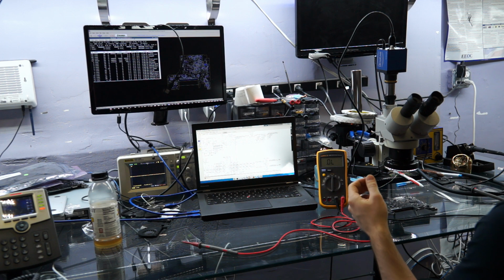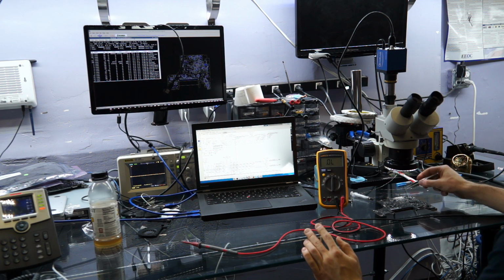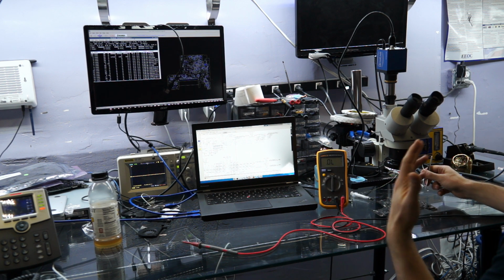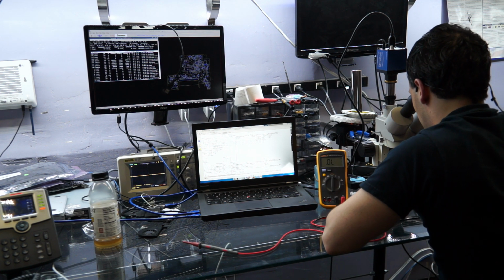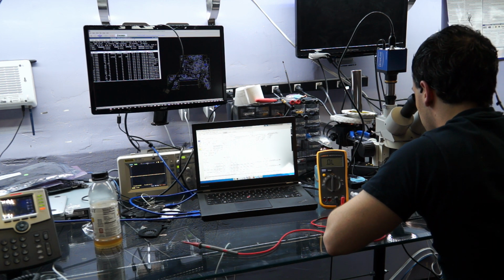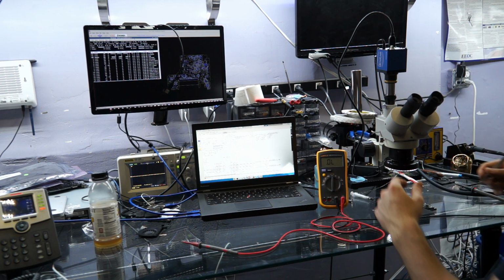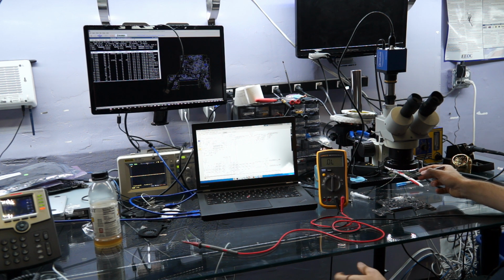Such is life. So the way I solder that underneath the chip is I use a combination of leaded and lead-free solder. Now, lead-free solder has a higher melting temperature, around 217 to 235 Celsius. Leaded solder has a temperature around 180 Celsius. The idea here is that I can solder the chip onto the board with the leaded solder, and while I'm doing that, I can use an amount of heat that's not going to melt the lead-free solder. So the whole idea is after I put this wire on and then go to solder the chip on, I don't want that wire to fall off as I'm putting this down there. That would suck. So what I do is I use the lead-free solder to solder the wire to that pad under the chip, and then I solder the chip onto the board. And that makes the whole process a lot easier.